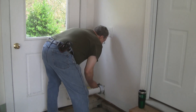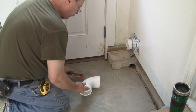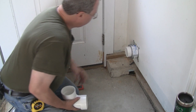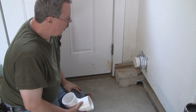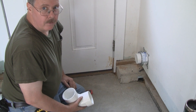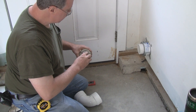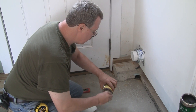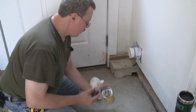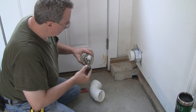So now we're going to put a fitting on this. The fitting is an inch and a half deep, so we're going to measure just a little less than an inch and a half. You'll notice that the pipe we use is thick — this is schedule 40 PVC. There are several advantages to that: it's not flimsy so if you knock against it, it's not going to break or crack. It also has some ultraviolet protection so that when it's mounted outside, it doesn't discolor and it doesn't deteriorate from UV rays. We're using non-toxic PVC cement, so you and I don't have to sit here and smell the fumes. This actually gives you a little bit more working time than your standard PVC.